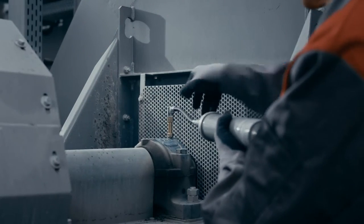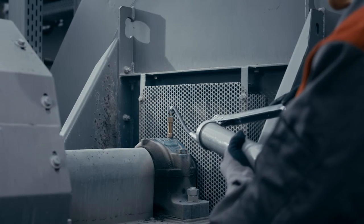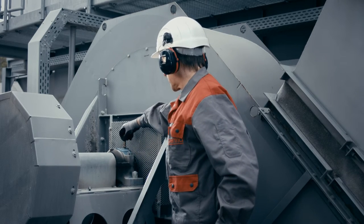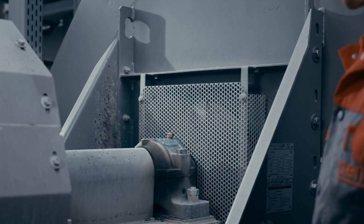Pre-fill the lubrication point and all accessory parts with lubricant. Be sure to use the same lubricant that is filled into your lubrication system. Always follow the manufacturer lubrication instructions. For remote installations, please ensure that all accessories and grease lines are pre-filled with grease.